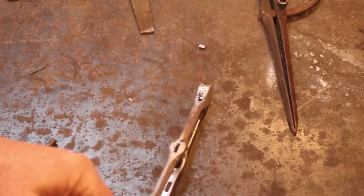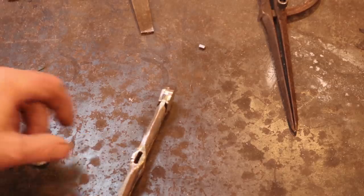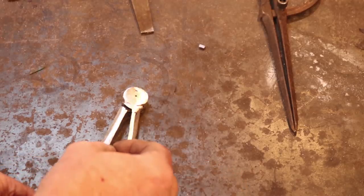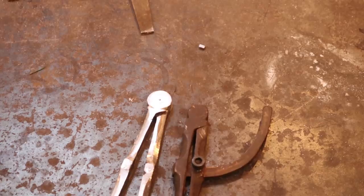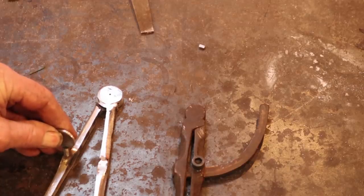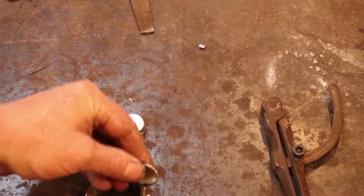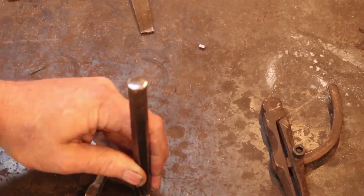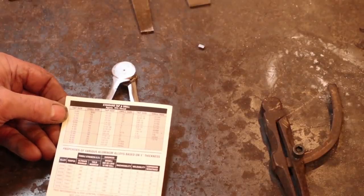We have to think about this a little bit. We've got one slot that was left small and tight and another slot that was drifted out a little bit bigger — that's the one the wing will travel in, so that's the one the thumb screw goes in. Now you have to decide if you want the thumb screw on this side or here. Almost all of the ones I have that are old have it on this side — with the exception of the ones Peter Ross made, which are on the other side, but he is left-handed so I don't know if that has anything to do with it. So we're going to go ahead and put it on this side. You don't want to crush that hole so be very gentle center punching.